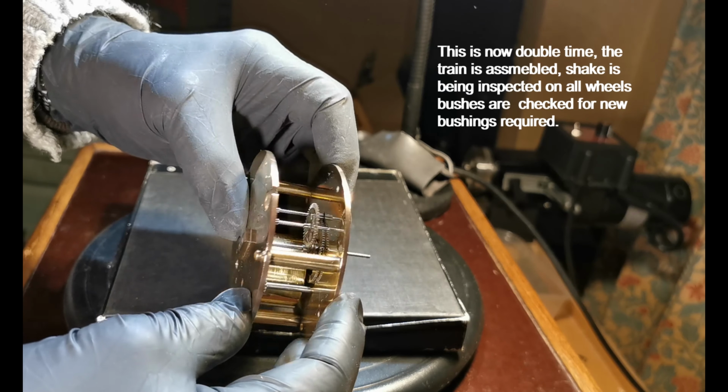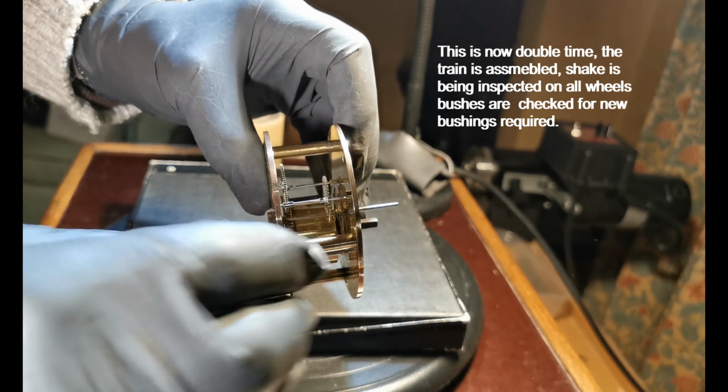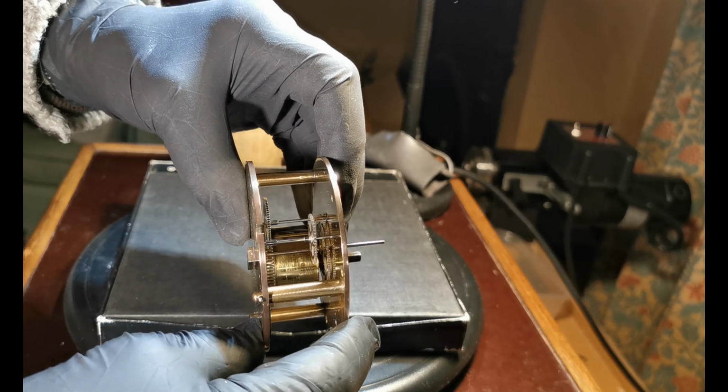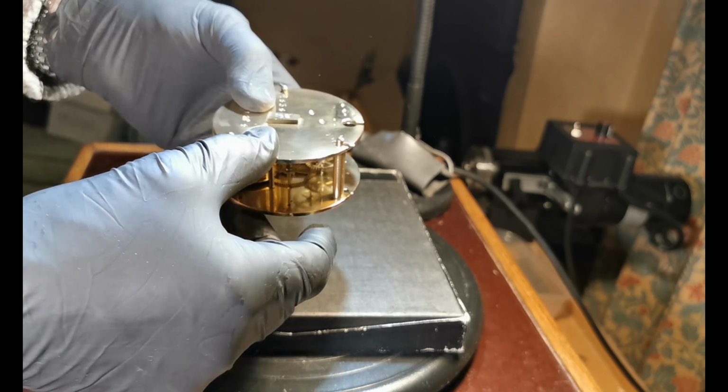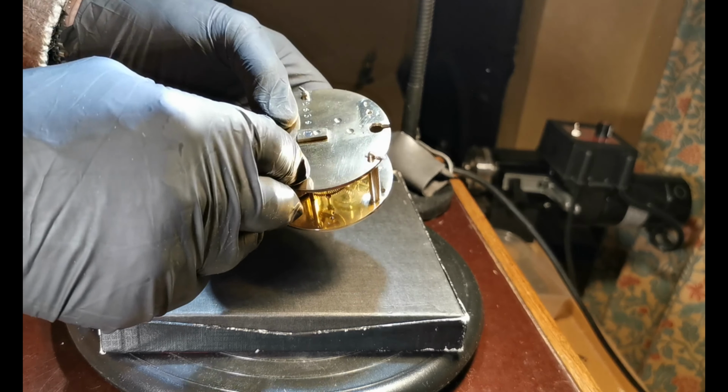But this is very good quality. So I would assume that it's way back in 1900, probably before, because the thickness of the plates are generous. No, I mean, you don't need plates that thick unless you're really making something of good quality. They're usually 1.5 millimeters, and these are 2.25 millimeters. So I will now progress and put the arbor in, scratch at the back, and then build up the front, and I'll come back later.